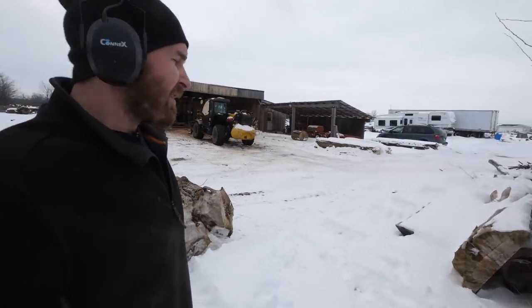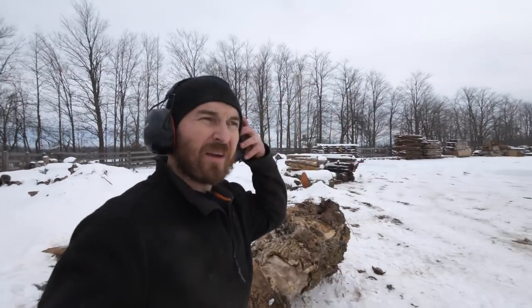So exciting to get this stuff dried. This is the type of material — maple — we can actually put right into the vacuum kiln and dry it right away. If I wasn't busy and didn't have a backup of lumber, I could literally have this dry in about 14 days, and we're talking about three-inch thick material. That's actually taking it relatively easy in the vacuum kiln, but I would not want to damage this stuff. Maple dries very nicely in there. Walnut is actually one of the harder ones to dry in North America — White Oak being the most difficult. With walnut, you can easily have honeycombing, and the colour of walnut is also very particular, so we have to air dry walnut for about two to three months per inch to get a much better result.